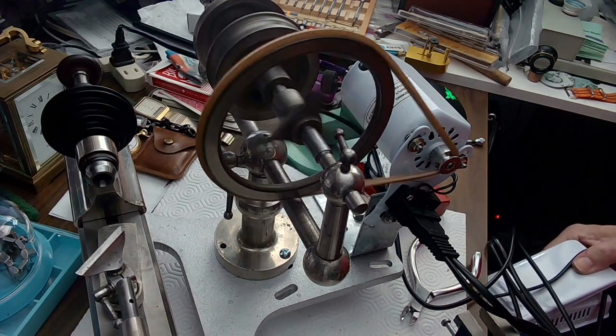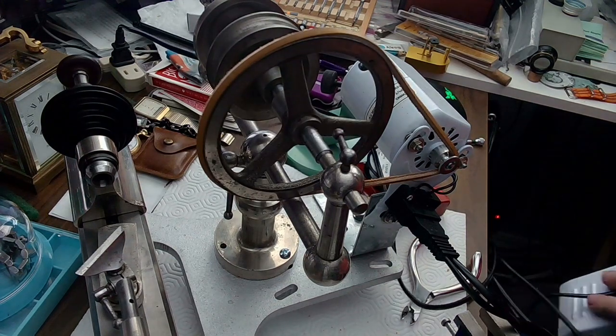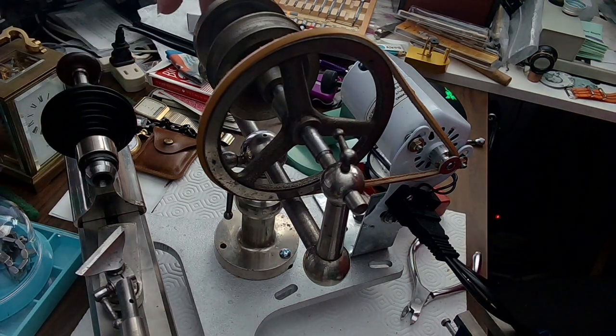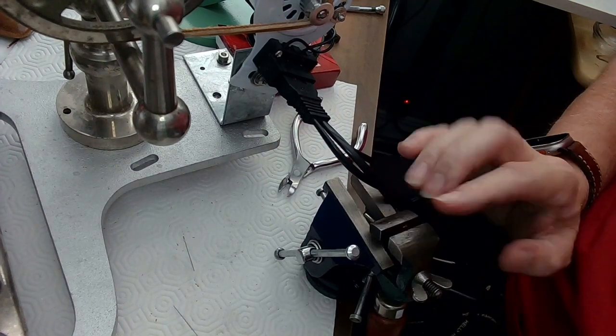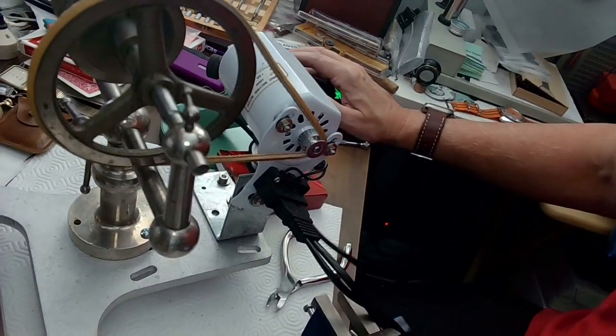That's my video on how to make a belt. When you make the back belt, put the boot lace in first and then measure it out like I did, but you've got to turn the lathe sideways so you have access to this area. You want some kind of plier rig to hold the two pieces of leather beside each other, ream it, and sew it — and you're good to go. I'm JD, thanks a lot for watching. That's how you make a leather belt for a lathe — highly recommended, I've never had one break yet. You can use tons of fishing line, so if you screw up just use more. See you later.